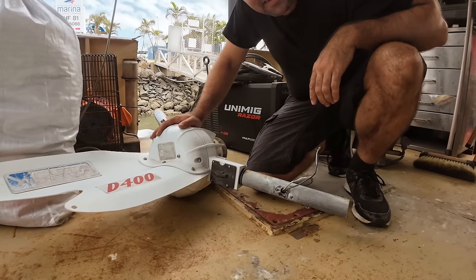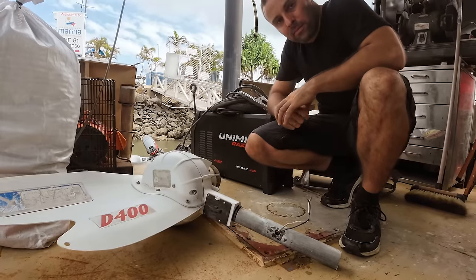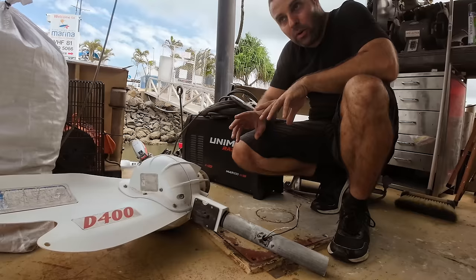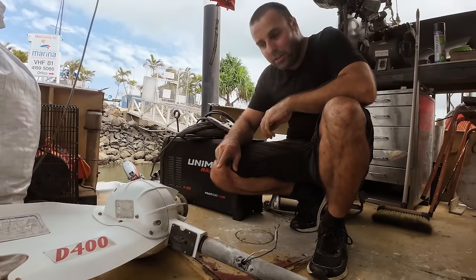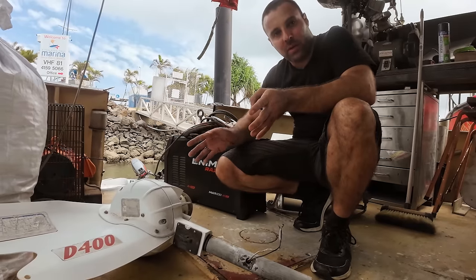Yeah, when solar's not possible. But with our ones, even with not great sunlight, we're still going to get plenty of power. But when there is no sun, yeah. And for people that think, okay, we're a motorboat, we're always going to have power whenever we're motoring, that is true. But there's always a fuel penalty. So the more we can generate with renewable sources, the less load we put on the engine, and therefore the less fuel we burn, and the further we can go with the available fuel we have.